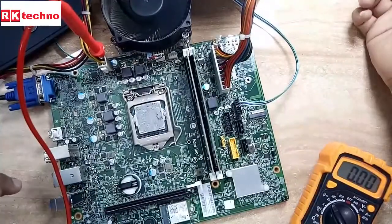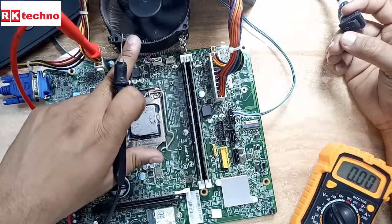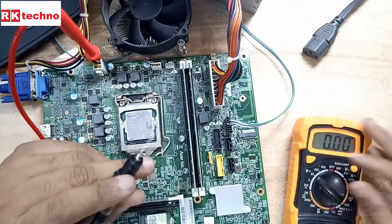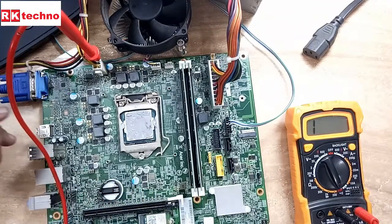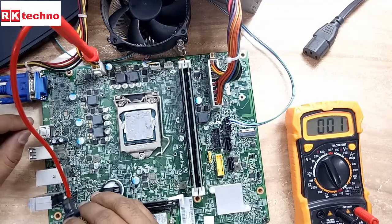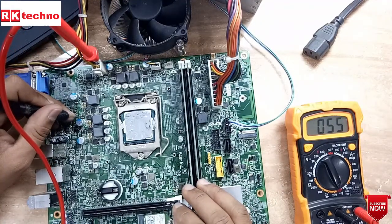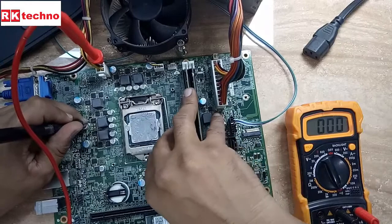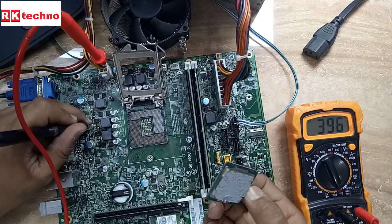Now I am going to cut the power off — the SMPS. Going to cut power for the SMPS. The fan is off. Removing the cable behind the SMPS. Now I am going to check for short circuit. The meter setting is perfect. Checking step by step on the coil — here is the MOSFET drain, there is no short. But here is the source — because of the CPU inside, that is why we are getting 00 ohms, a short circuit reading. I remove the CPU and there is no short circuit.